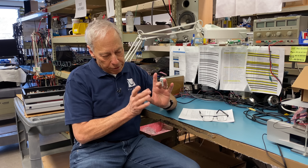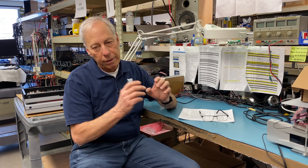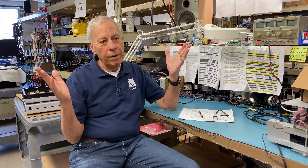The same is true in an FPGA. FPGAs — it stands for Field Programmable Gate Array. All it really means is it's like a microprocessor, but unlike a microprocessor, this many-million gate device is not pre-programmed to do specific tasks. In a microprocessor, like an Intel 8080, you might have the same number of transistors and components inside the chip, but each section is dedicated to specific functions — the brains, the memory, and so on. In a Field Programmable Gate Array, all of them are just sitting there like stem cells. You can do whatever you want with them — we program them. You could actually make an Intel 8080 on an FPGA, just program it.